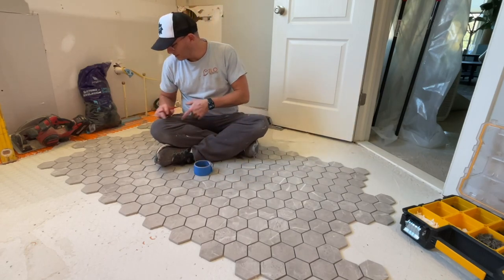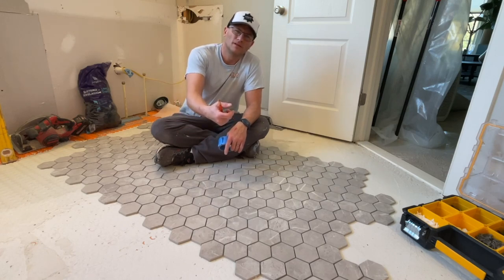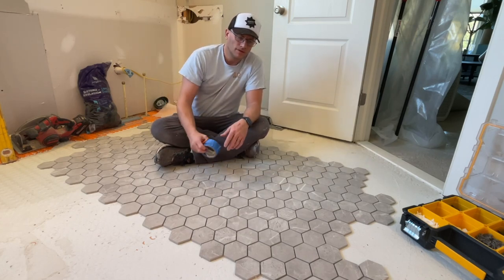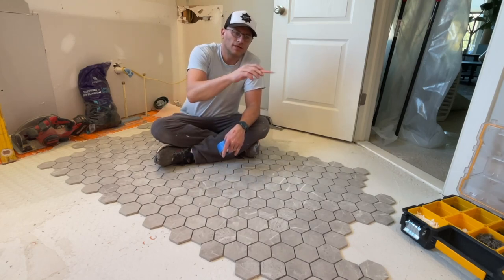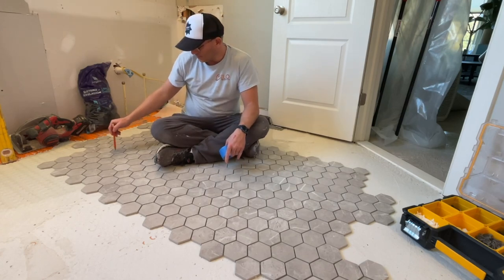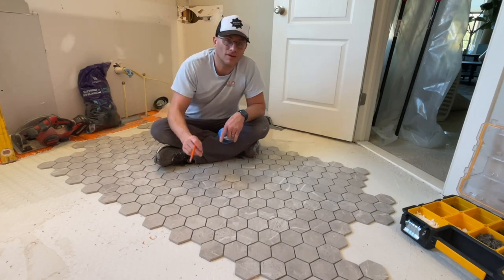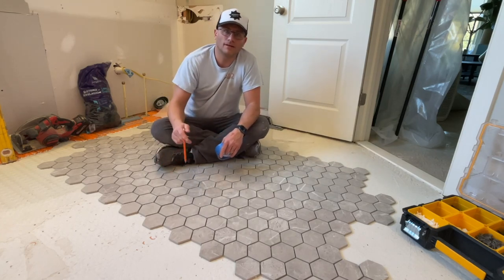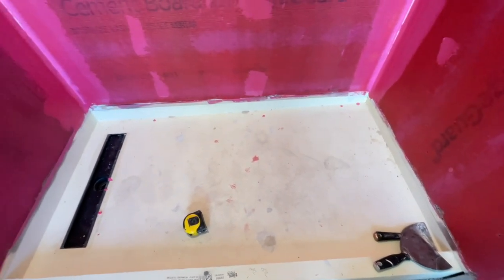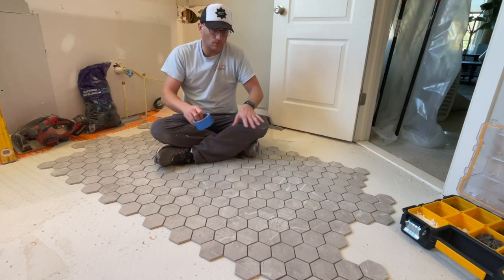The first step is done — I laid it out. I have my measurements: 58 and a half by 30 and a half. I've been watching videos where people use glue guns and little luan strips, but I feel that's overkill. I use tape. I mark it out and take about a quarter inch off on each side of the wall. So if the measurement is 60 inches, I'll come in to 59 and a half. That gives me my working measurements. Keep in mind with a thinner tile you have to be a little more exact. This is a tile-ready base so I know it's square.